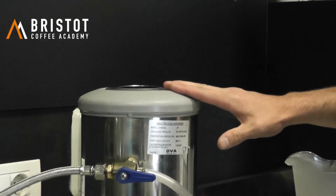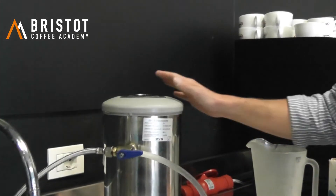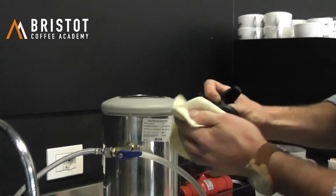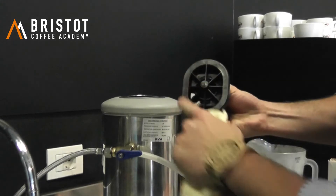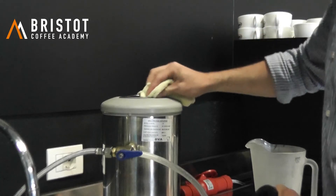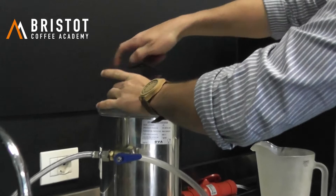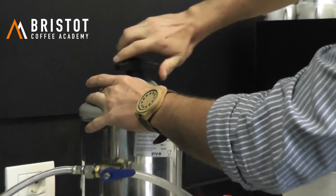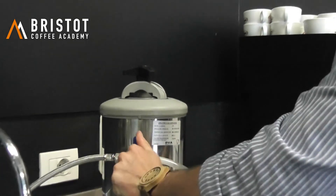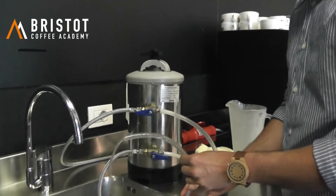If you have the bigger one, which is 12 litres, you need two kilos of salt or table salt. The salt is in, so now it's time to clean the lid — there are some residues of salt or resins. Also clean the top, then close it, put it like this, close it tightly, and then move the first tab back to the first position to let the water come in and start the regeneration, and the second tab like this.